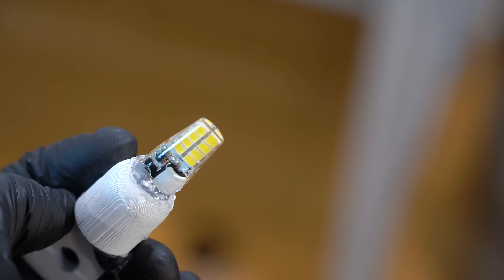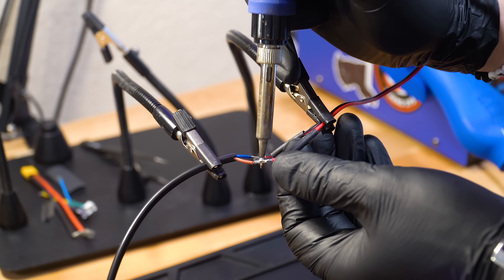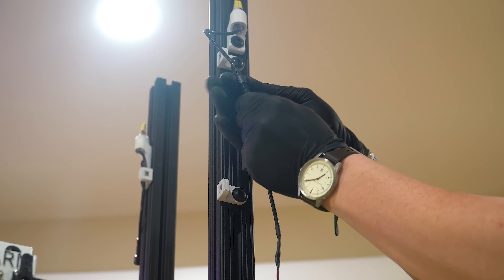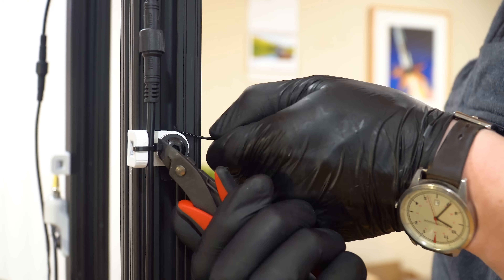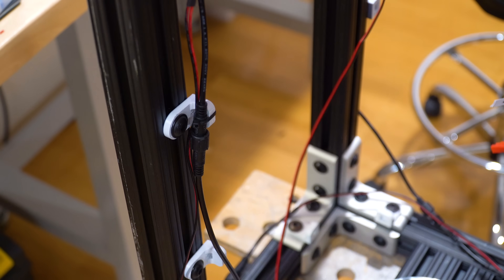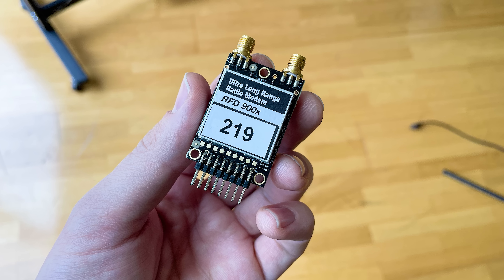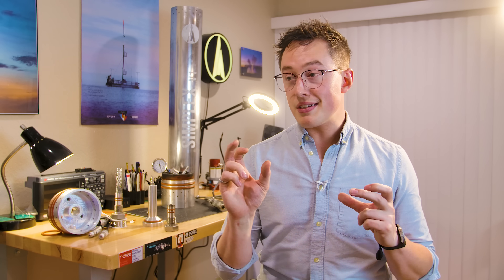Back to wiring. I used very bright LEDs in little 3D printed mounts in the hopes that if we ever do a test at dusk it'll look absolutely incredible. I ran all cables down to the electronics section with easy disconnections at either end, because when we fire larger motors I may want to extend the length of the test stand, and easy cable disconnects will make that a lot less painful. The radio works on 900 megahertz — it's an RFD-900, the same type I use for most of my rockets. I had a little trouble getting all my electronics to play nice together; specifically the radio and the 24-volt boost converter did not like each other, but once I sorted out the gremlins I headed outside to get some beauty shots.